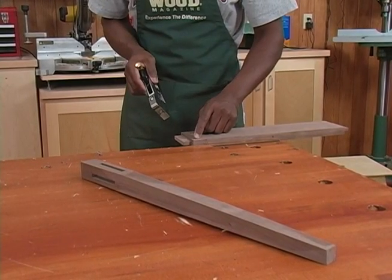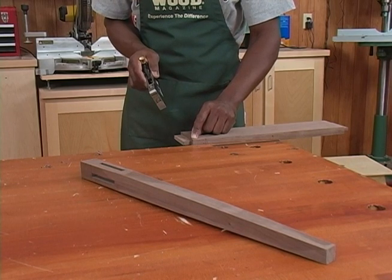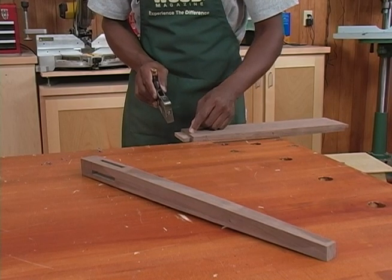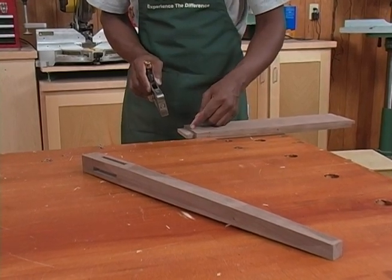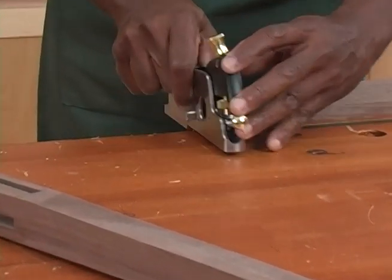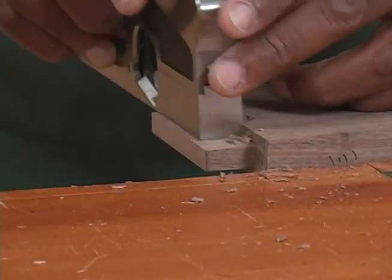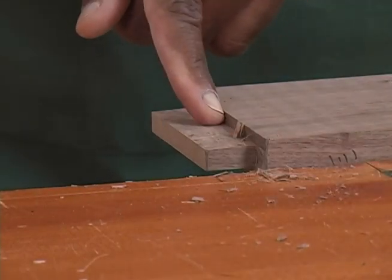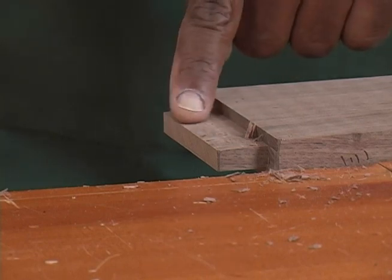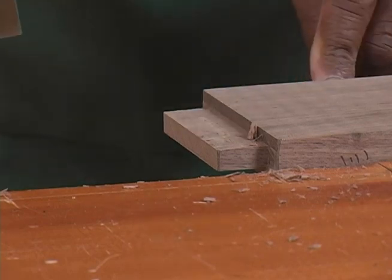In some situations where you've carefully prepared the exit sides of your stock, you might still experience a little bit of unwanted blowout. It's not against the rules to reverse the planing action of your tool and attack it from the far side toward the middle, while also doing it from the near side toward the middle on this side. You still want to be careful to overlap your strokes, paying careful attention to this inside apex where the shoulder and the cheeks of the tenon meet. It's very easy to get lulled into removing too much stock on the exit side, creating a wedge rather than a tenon with good regular geometry.